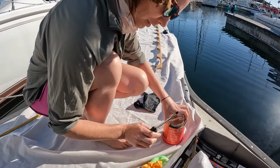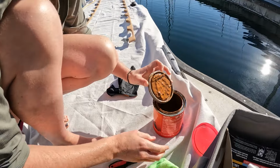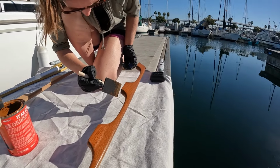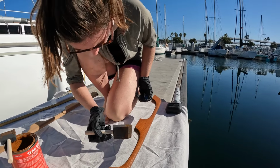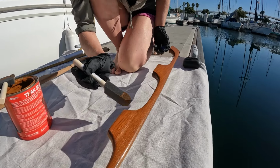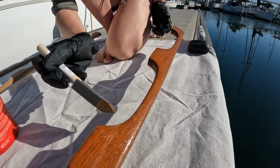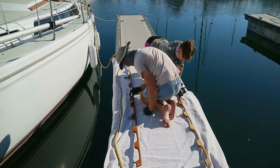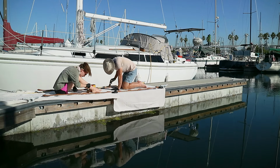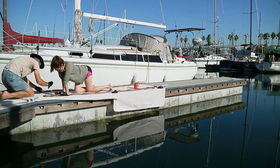No, we are not sponsored by Starbright, they just happen to make good products that are easy to come by. The product recommends using foam brushes to apply the sealer on the teak, which we did. We slapped on 4 coats of Teak Sealer on the rails in one day, as each coat only took about half an hour to be tack-free. It is important to follow the grain as you apply the sealer and do very light coats.